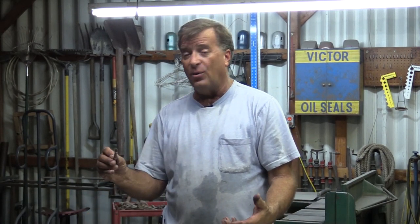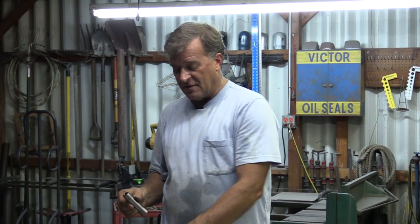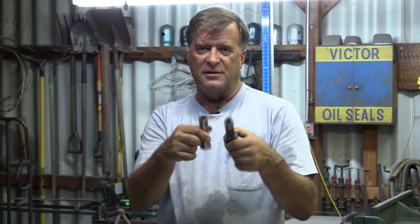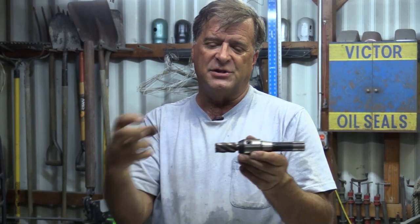So do you need them? Collets? Yeah, you've got to have them — at least when you're talking about TIG welding. You've got to have the collet body and the collet, and they've got to be the same size to fit your tungsten, so all three pieces need to be the same size to work together correctly. With the mill? No, you really don't need collets — you have tool holders instead. This fits up into the same spot as the collet, held in by the same drawbar and knob on top, but it's got a straight hole inside. The end mill has a flat spot ground on it and a set screw, so you just put your end mill in, line up your flat spot, tighten down the set screw, and get to work.